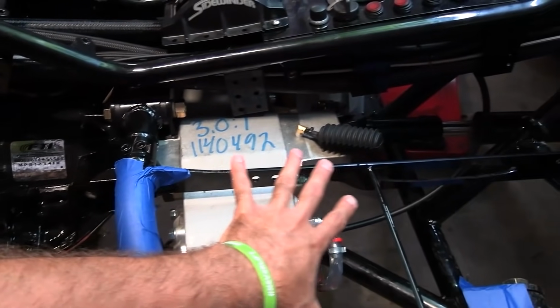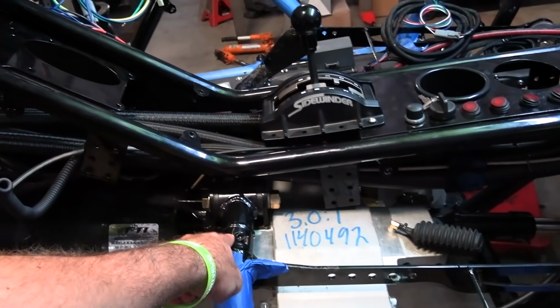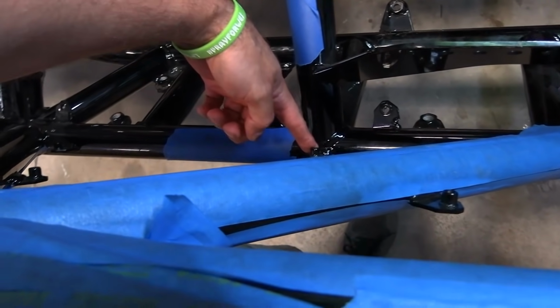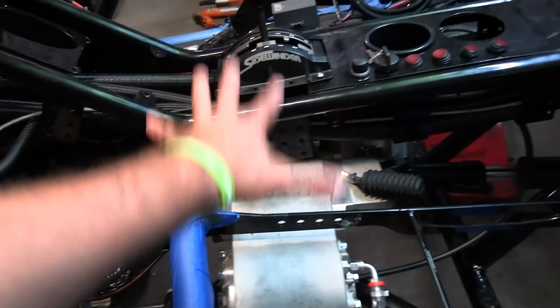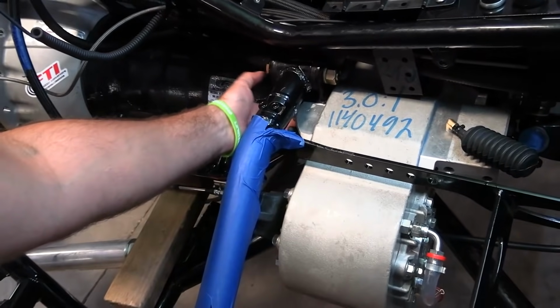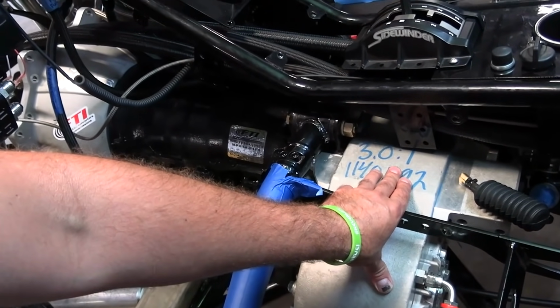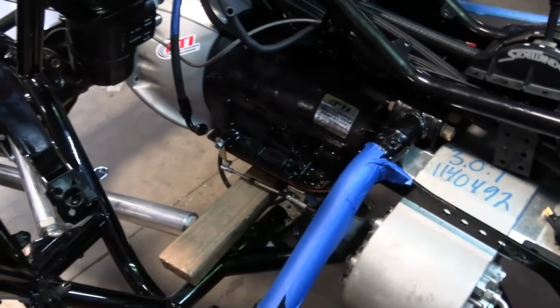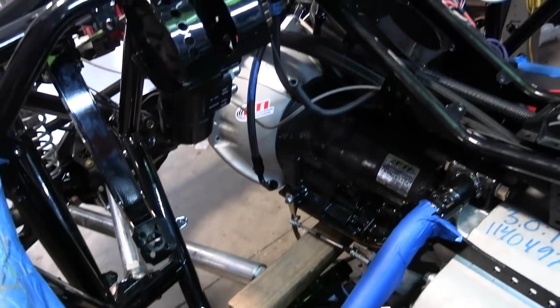You can see how the entire drivetrain actually hangs off of this piece of tubing. Basically, the tubing comes down here to this point, comes up, goes across the top, and then we've got our two bushings inside here, and the drivetrain actually hangs off the top. So what we're working on now is getting the shifters and everything installed, and drive shafts and all that stuff ready to go. We've got shift linkage. I mean, we're just about as far as we can go with this.